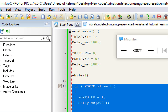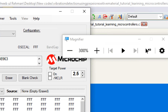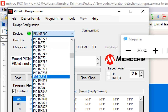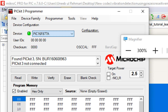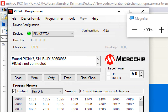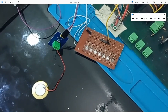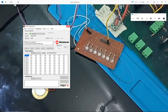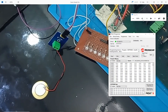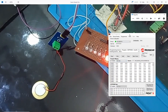The code is built with no errors detected. Now I burn it using the PICkit3 programmer tool. Select the microcontroller — PIC16F877A. Go to File, import the hex file we just created, and click Write. The file is being written. The file is burned — let me power up the PIC using the PICkit3 programmer tool. The circuit is powered up.